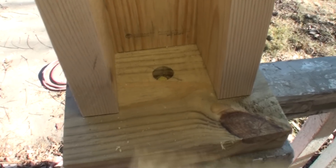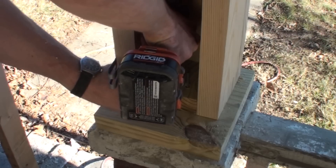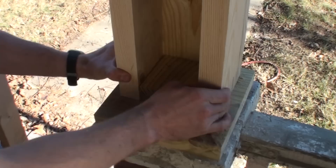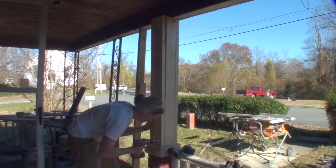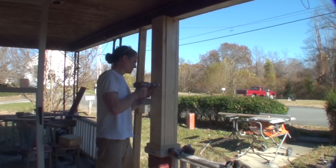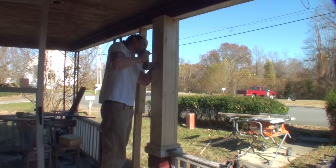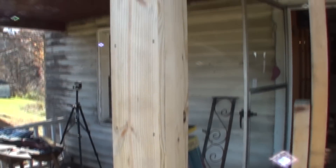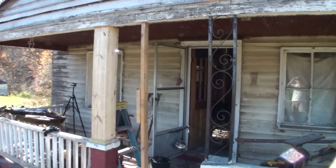This is the inside of the column. The reason I didn't assemble these on the ground first is because of these blocks — I call them my registry keys — that keep the column in place and prevent it from shifting. If I pre-made them on the ground I wouldn't be able to jack the porch up high enough to get them over that block without breaking something. So I assembled them right in place, one at a time, with all screw holes pre-drilled and countersunk.